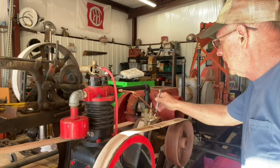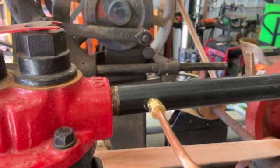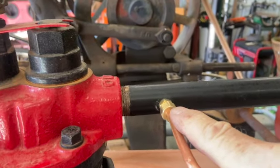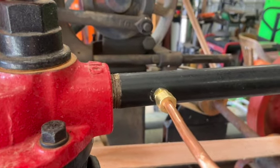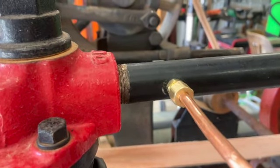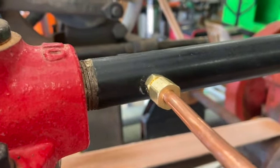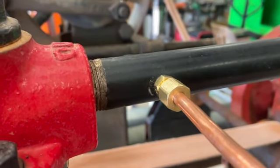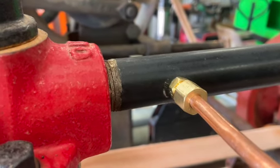One sensing line complete. For those of you concerned about chips and shavings getting into the pipe when I drilled and tapped it — I didn't show it on camera, but I got the shop vac back out and sucked that out real good, then put some grease on the end of a small screwdriver, went in there, and fished around a little bit and picked up whatever swarf was left. No worries — that's all clean.